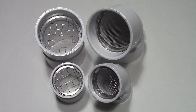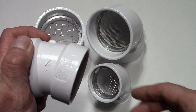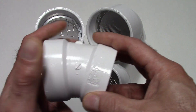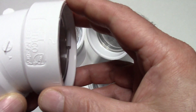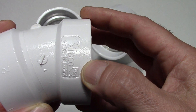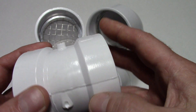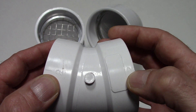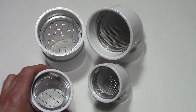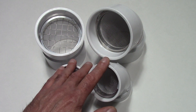The easiest way to determine the size of your vent termination is to actually take a look at the hub itself. Generally speaking, most vents are terminated outside of a home with a hub, and they point downward. So if you look closely at the hub itself, you can see the number two is embossed on it. That's because this is a two-inch hub, and it will be on the other side as well. Our PVS RS2 and PVS IS2 vent screens are designed to fit into two-inch hubs.